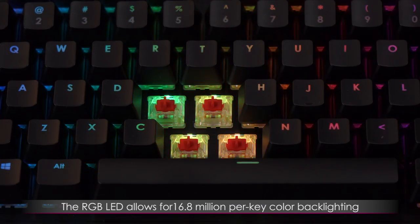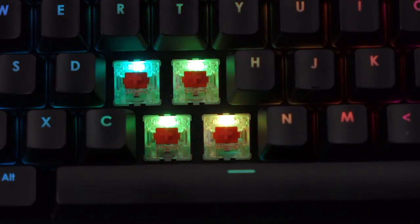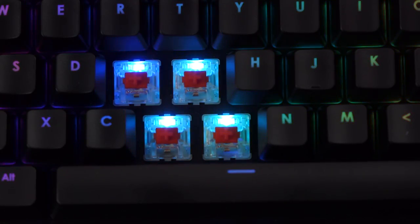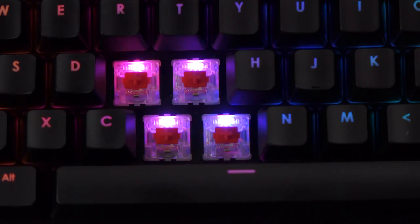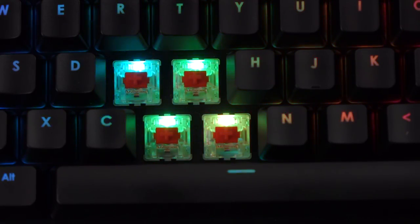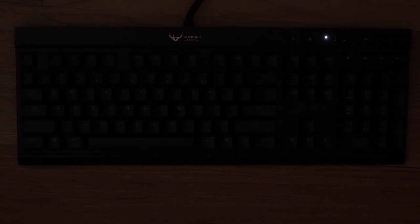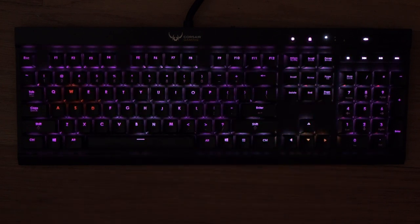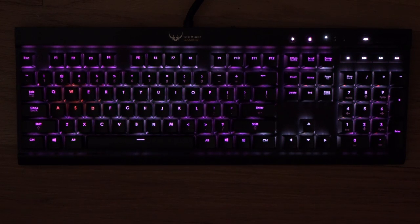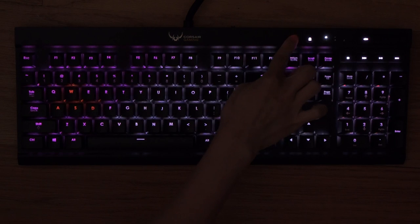Let's talk about the LED. Normally you'd see the LED right on top of the switch, but in order to get this RGB effect, the LED is instead beneath a clear housing. The LED is 5 millimeters in size and surface-mounted directly onto the keyboard's PCB. Light is emitted through a computer-calculated lens in place of where the LED used to be. Here's a demo: this is level 1, level 2, and finally the brightest setting.